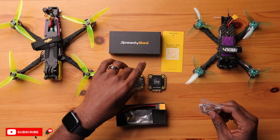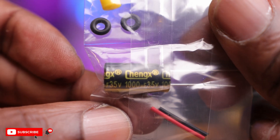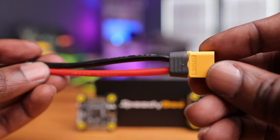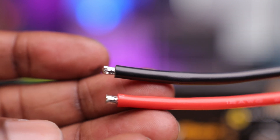There's also another harness for your VTX. This VTX connector supports the DJI O3 air unit, the original air unit, or the Caddx Vista VTX. Next you have your hardware — some grommets, nuts, bolts, and a large 1000 microfarad capacitor. Last but not least, you have a beefy thick power lead with an XT60 connector. The insulation feels like silicone, which is good for heat isolation.